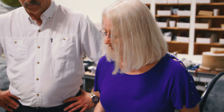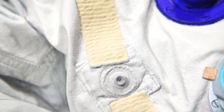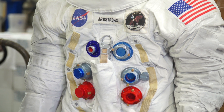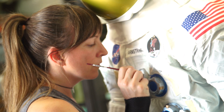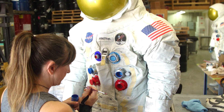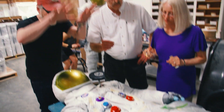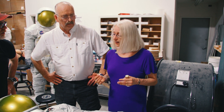They take many coats — some enamel and some acrylic. We start with putting green tape on, taping off all around these ports, masking so we don't want paint going on other things, and then we do multiple layers. For example, this red — two coats of a basic red and then a pearl red. The gold is actually an enamel. And this, of course, has to be painted red on the inside, silver here — four coats. It just takes a lot of attention to detail to get that right because we want it to look authentic. One of the hardest things to replicate is the look of the chromel — the metal mesh that makes up the gloves. We settled on a pewter that just captured the look.